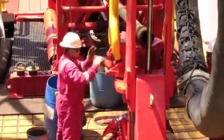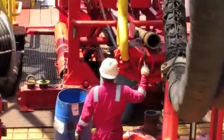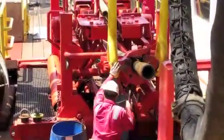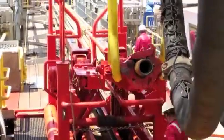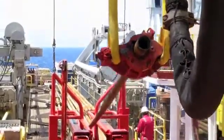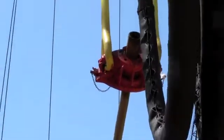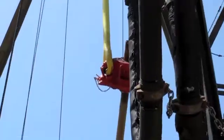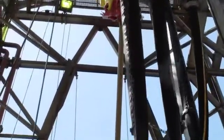Now he's attaching it to another elevator and the next piece of drill pipe coming up from the pipe racker, and latches that in. He's picking up a standard drill pipe now as the traveling block goes up into the rig. This piece of drill string is a stand — it's 30 meters long, or about 90 feet. We lower it one piece at a time, one stand at a time, until we have a string that goes all the way down to the sea floor.